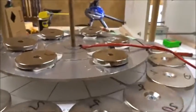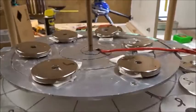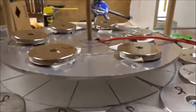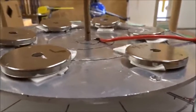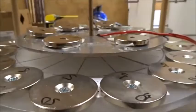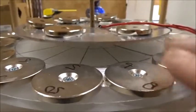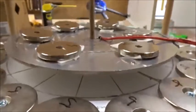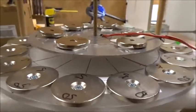For the final experiment, we have a ring of 16 magnets with an aluminum disc carrying six 40-millimeter magnets hovering above. We put a current one way and it just shoots down quite strongly — this is reverse field levitation. When we reverse the leads, now it shoots up quite strongly. The permanent magnetic field here is repelling that field, and it's also repelling any field induced in the spiral. It's quite a big effect and well worth taking notice of.